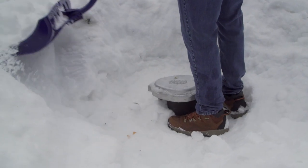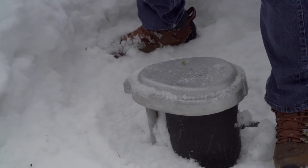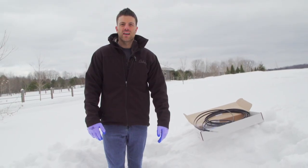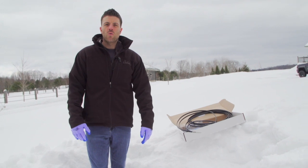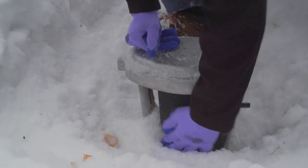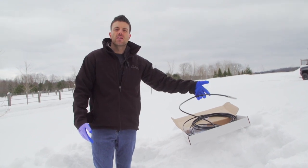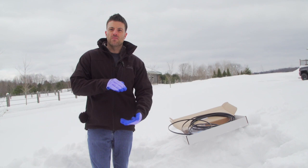The riser being the vertical pipe coming up from the pump. Today I thought we'd take a chance to have a look at a well that we found buried in about three feet of snow and shoot a quick video explaining some options. When you have a drilled well like the one here, one of the easiest and most simple things to do is to actually drape a heating cable, like this example I have here, right down into the top five to ten feet of the well casing.